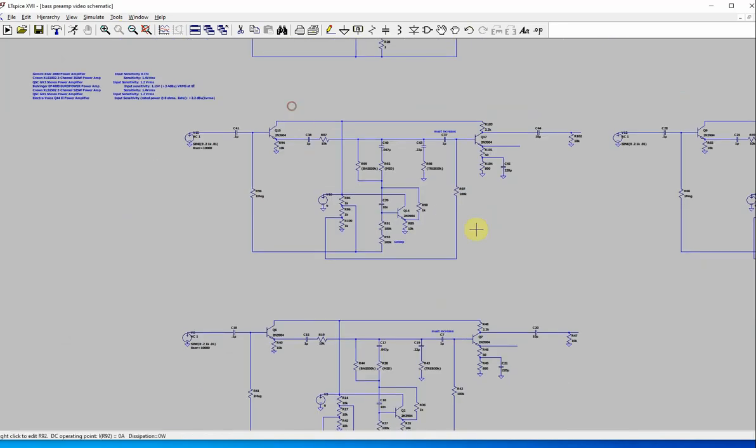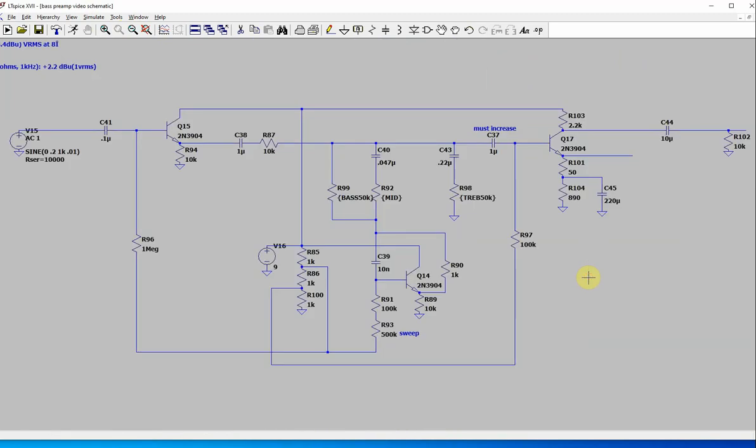So moving on here. This is the last. I know this is getting long, but I'm just trying to walk you through this. So, I switched things differently here. Instead of using an emitter follower here, I made an amp. This is a 1K potentiometer, actually like a trim pot, and I put the wiper on a bypass capacitor, and I adjusted this up and down until I got a gain of 10.